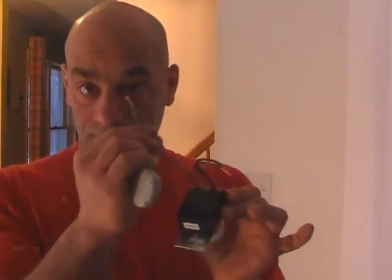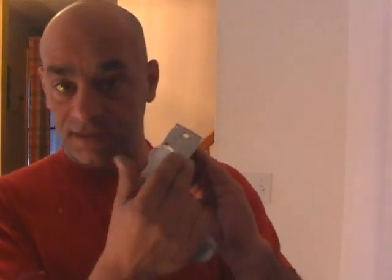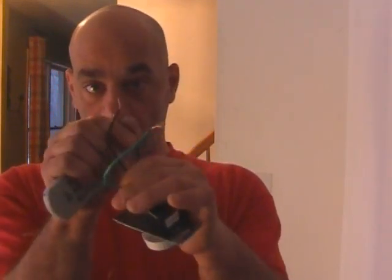You've got a green wire. This is your ground wire, and you'll have two black wires. Now, some switches, like the ones with remote controls, maybe one for a fan, perhaps, will have a load side and an input side. Well, in dimmer switches, especially ones like this, where you just hit the button and then turn, it doesn't really matter. You just have two black wires. What we're going to do is connect these to the wires on the switch and, of course, the ground. So let's go ahead and take this apart, and I'll show you exactly what I'm talking about.